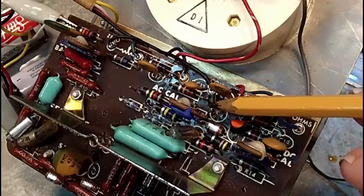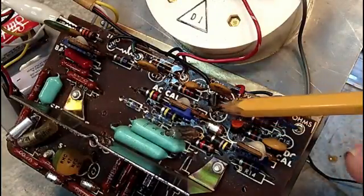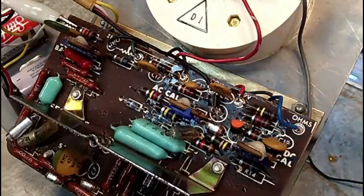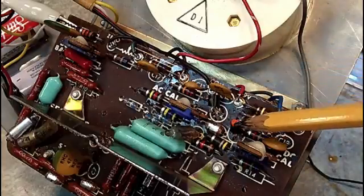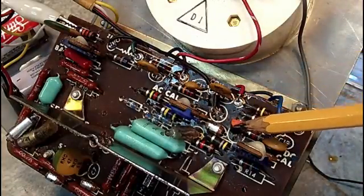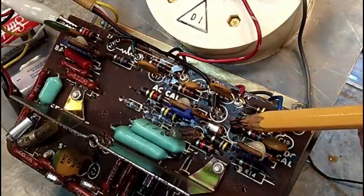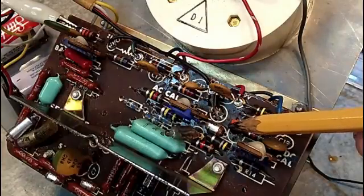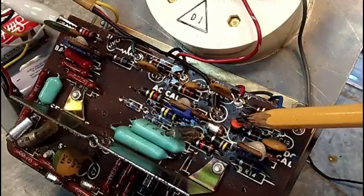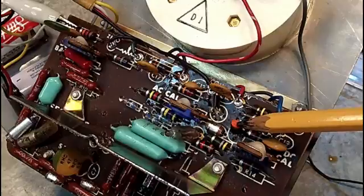Like I said, this pretty much leaves these transistors, and so I went ahead and measured them like I showed you just a second ago, and you saw, if you looked at it very closely, there's quite a discrepancy between the two. I believe it was TR1 shows that the source and the gate are practically the same voltage, and even the drain, the supply voltage is not that much difference.